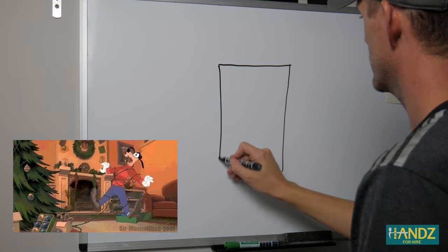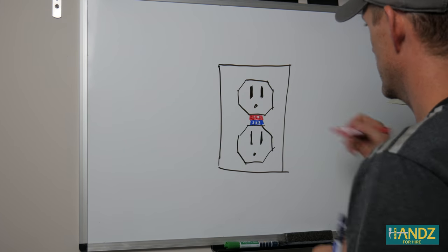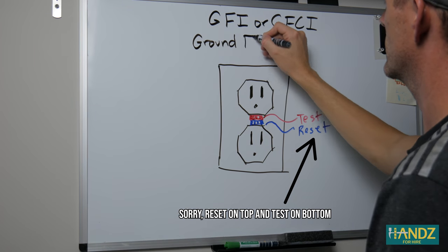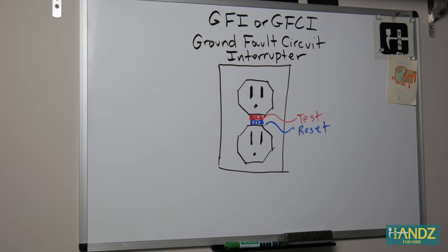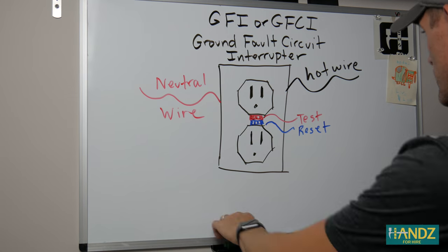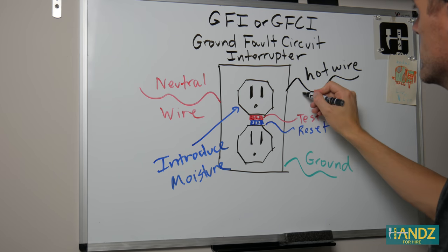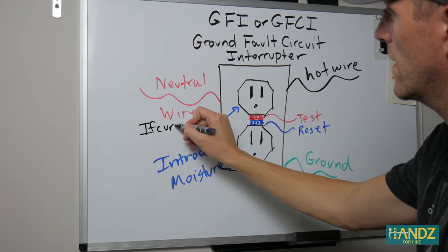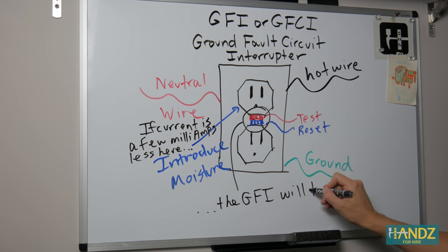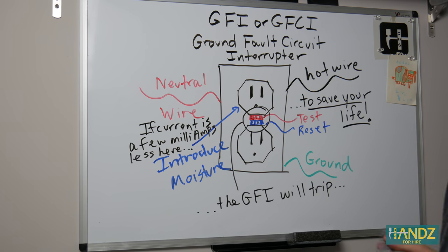Since nobody wants to be electrocuted, if there's any area where moisture is present you want to make sure a GFI is located there. You typically see them in bathrooms, kitchens, garages, unfinished basements that might get wet, and any outdoor plugs on the front or back of your house. What a GFI does is detect any difference in current from the hot side to the neutral side of the outlet, and within 20 to 30 milliseconds it shuts the whole thing down, reducing the possibility of tissue damage or electrocution. We've all tripped GFIs before — with a hairdryer, or in the garage plugging something in that draws too much current. They're annoying at times, but you have to be thankful because there are instances where if they didn't exist, we might not be here to tell the story.